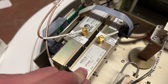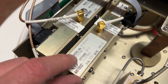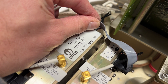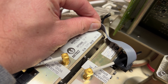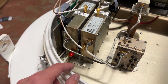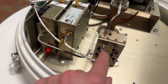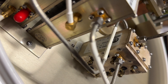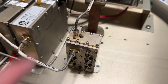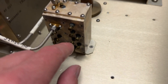Looks like these are the transmit and receive modules. This one's 10.579 gigs — Miniman TX. And Miniman RX 10.644. Manufacture date March '96. We've got a couple of good hardline SMA connections here as well. This is a diplexer — a 10.5 gigahertz diplexer. That allows these transmit and receive to operate at the same time, which is pretty cool.